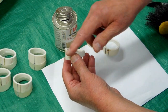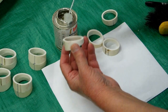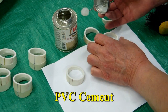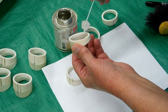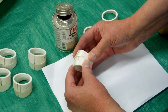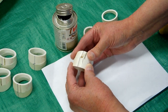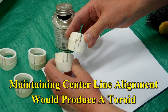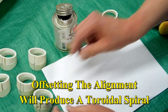After you sand these, clean up the edges real well — we don't want any little pieces of plastic interfering with the glue joint. I'm just using PVC pipe cement. Put it on both sides of the joint, bring them together, rotate back and forth a little bit. I'm just barely offsetting that joint. Set those down and let them dry for an hour or so. Make sure that glue is good and dry and that joint is good and hard.